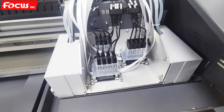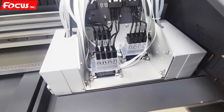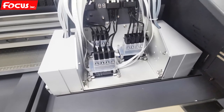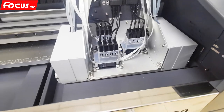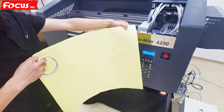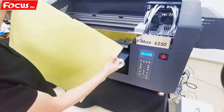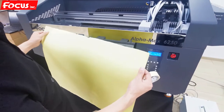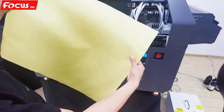This is all the procedure for head cleaning and load ink, but right now we also don't know if all the ink is going through or not. We can put paper on the table and do a nozzle check print to verify. Before we do the nozzle test, we must find a transparent paper so we can see the white ink and varnish nozzle print, because if you put white paper we cannot see the white ink and varnish clearly. For better detection we use transparent film.